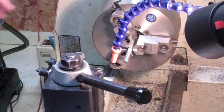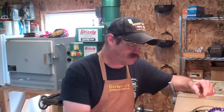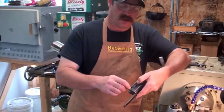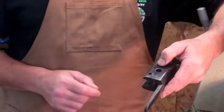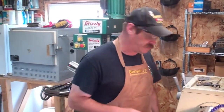All right, so let me go back, set up, and start turning the larger diameter for the head on this thing. The diameter on my rod right here is 312 thousandths, and we've got to make the head diameter fit in this hole right here — it's 275. So we're going to have to take about 37 thousandths off the outside of this. So let's go ahead and get started cutting this.